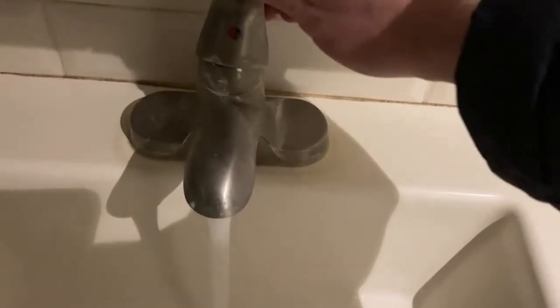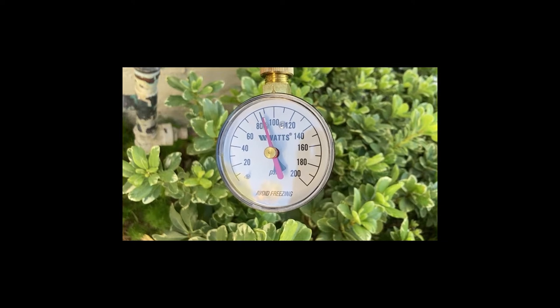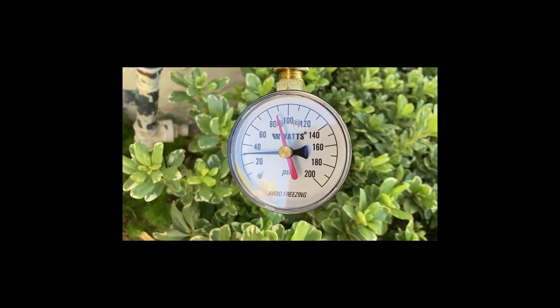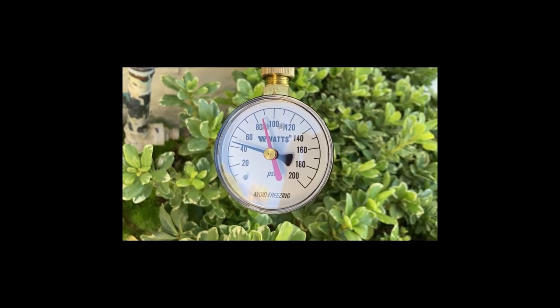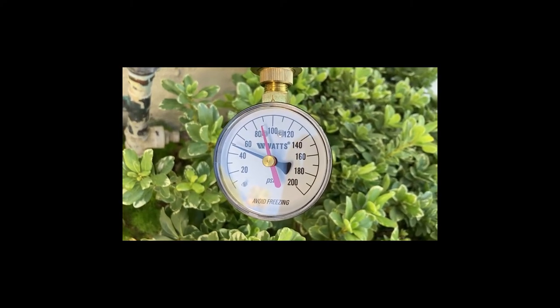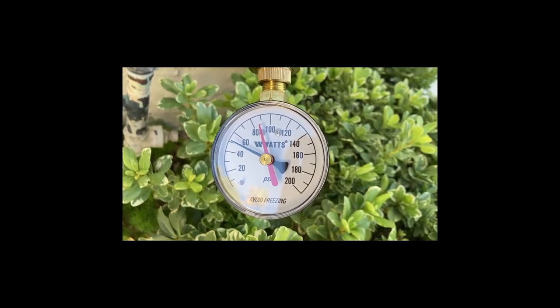When a faucet in the home is opened, the pressure decreases down to 29 psi in about 2 seconds. The running water pressure in the home is 29 psi right now. After the faucet in the home is closed, the pressure first increases quickly to 45 psi and then increases slowly up to the static pressure 85 psi in about 1 minute.